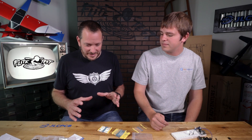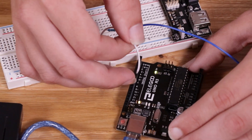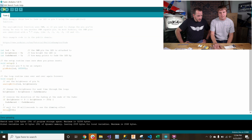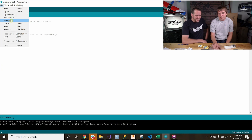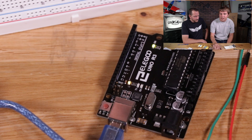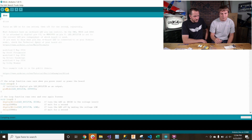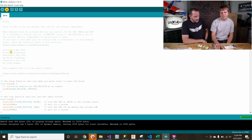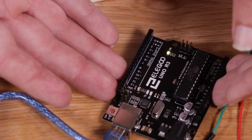Typical when I start playing with things, I get myself in a corner and just want to set everything back to zero. How do you take this Arduino back to nothing? One way is to pull the wires out, disconnect it from the circuit, go to File > New, and you get a new blank sketch — that's what they call programs in Arduino. Hit upload and we're back to a blank slate. The Arduino actually ships with a program on it called Blink, which is available in the examples under Basics. It just turns pin 13 on and off with a one second delay — a thousand milliseconds — and you'll see that pin 13 LED blinking. That's how the Arduino will ship to you.